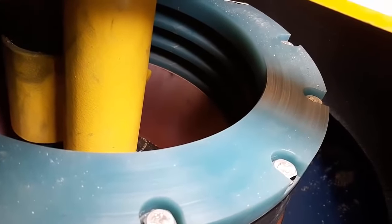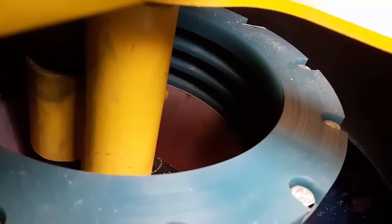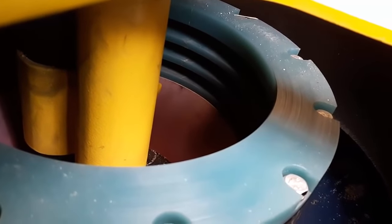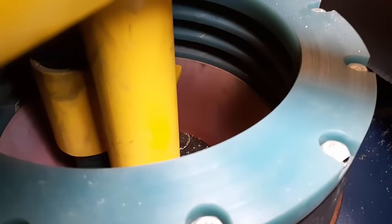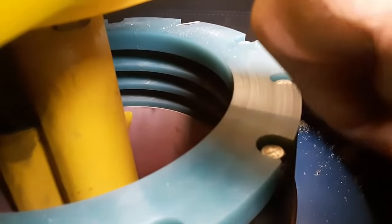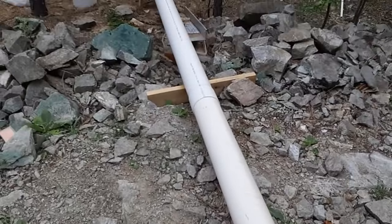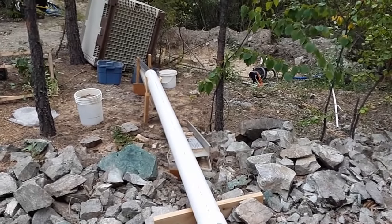So the combination of the tub spinning really fast creating artificial high gravity, the water flowing over the riffles just like in a sluice box, and water being jetted into the bottom of each groove creating fluid beds — creates the perfect environment for capturing the finest of fine gold. That is why fine gold recovery is so amazing on a gravity concentrator or centrifugal concentrator. The tailings — the stuff flowing up over top of each riffle — is just being flung over the top of the tub. It comes up over this edge, flying off, hits this rubber on the side, falls down, and out the discharge port, and in our case all the way through our little safety sluice and into our tailings pond.